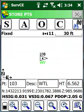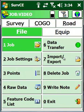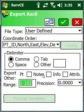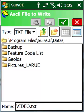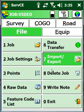Once we've completed collecting all the points we need, go back to the file tab, go to import/export, and export our points as an ASCII file. Select user defined: Point ID, Northing, Easting, Elevation, Description. Tell it a range — we'll do All. Hit check mark, give it a name (it defaults to the job name .txt), and save the file.